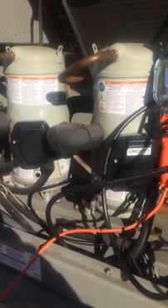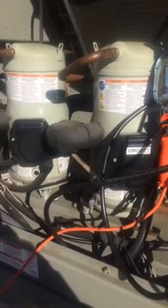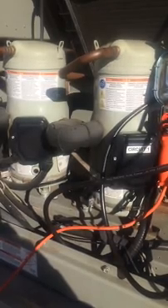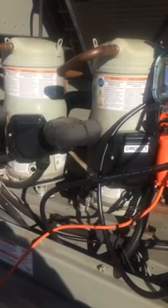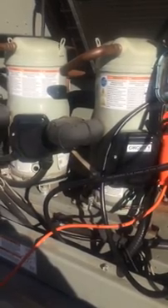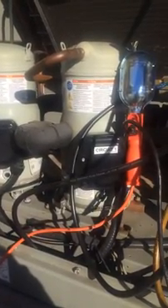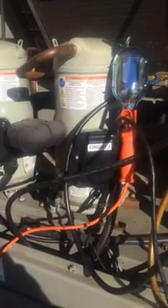It might be passable, and when you put a charge on it and charge it up it will probably be okay. But if you needed to confirm a system was tight and you wanted to see numbers below 500, those bubbles are going to have to go away. So just a tip for whoever works on these systems — 410A, POE oil — if you see that on any of these compressors, you've got to keep pulling a vacuum on it. If not, then you're good to charge it up as long as your micron numbers and everything else looks good. Appreciate you all for watching. Take care.